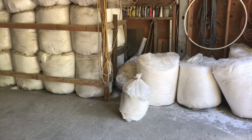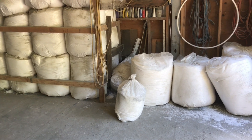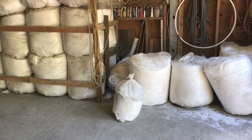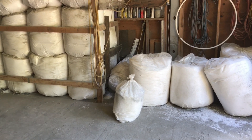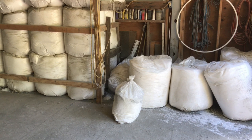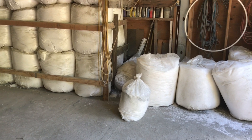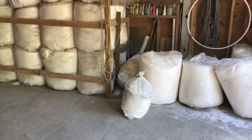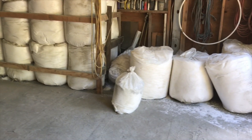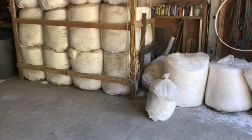I want to discuss the reasoning for using this foam cement mix on this spa project. In years past, we would dig a spa and place the gunite shell directly onto the dirt with no foam mixture layer. But after hearing customers complain about how much propane they were using to heat the spa, I thought it'd be nice to insulate the gunite shell from thermally conducting the heat into the ground. Gunite is a great conductor of heat from the body of water into the dirt. So I came up with putting a four to six inch layer of styrofoam, then the steel, then shooting the gunite — it was a thermal break I was after.